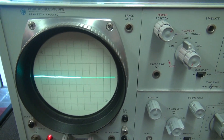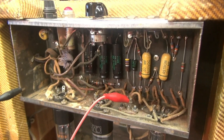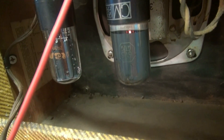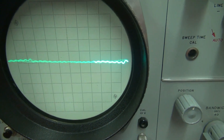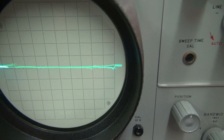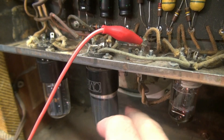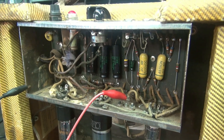I've got the amp powered up and monitoring on the old boat anchor HP 140A. Volume is about halfway up — just putting my hand near the input. Hear that? That's because those shorting plugs aren't working. Looking at the scope, moving tubes around — listen to that. Everything in here is acting up. That's probably those bad connections. Let's get that fixed.